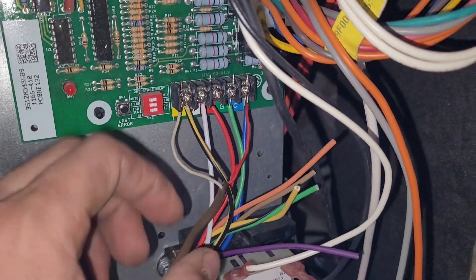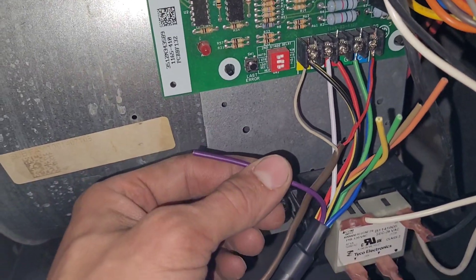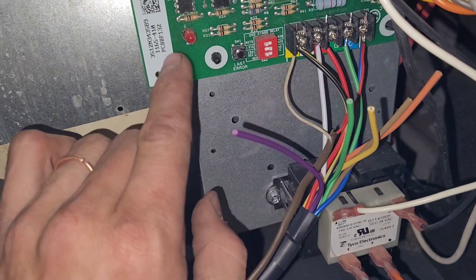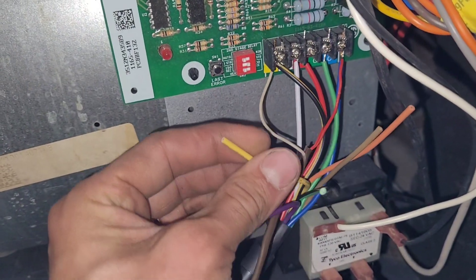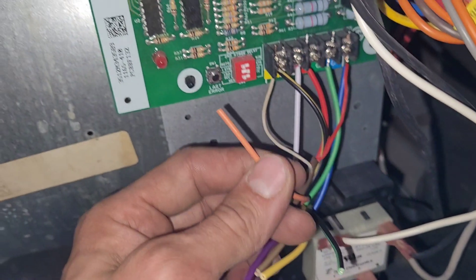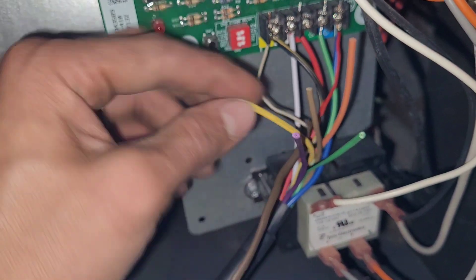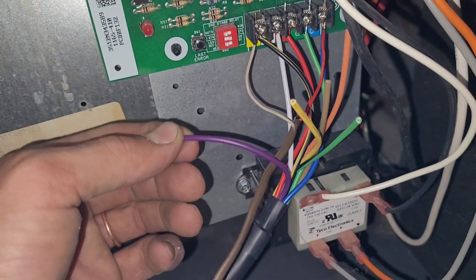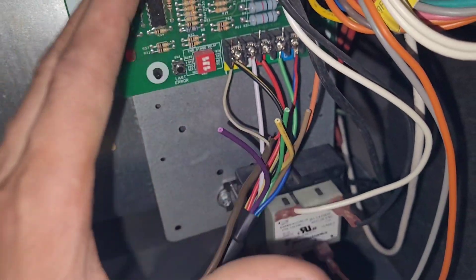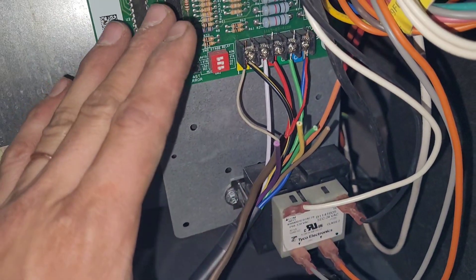The C allows the controller to use the 24 volts — this is just a 24-volt common. The other wire on the C goes out to the air conditioner. We have extra wires here because this is the simplest control board you could probably hook up to. The purple is the humidifier wire which we're not using. The A2L wire is only used on boards that have an A2L terminal. The second stage cooling wire — not using that. The brown one is the second stage heating wire and the orange one is the reversing valve for a heat pump. So we're just going to leave these disconnected and cut. They're safed off enough just having the wires cut flush like that.